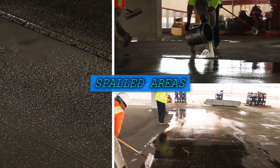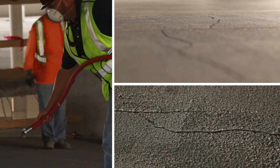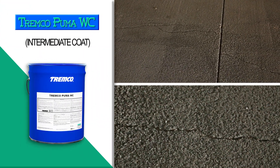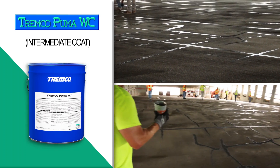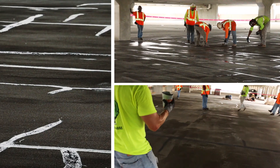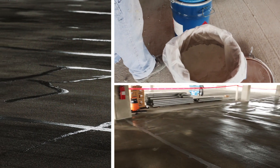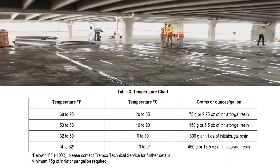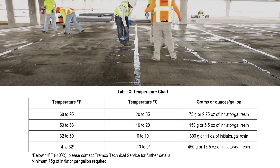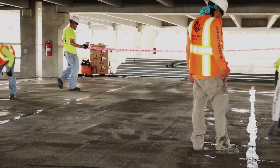Spalled areas should be cleaned and free of loose contaminants prior to repair. Due to the fact that job site conditions vary, it's recommended that you contact Tremco's technical service or your local Tremco sales representative for the best method of repair. Mix Tremco Puma WC for 2 to 3 minutes prior to the addition of the silica sand. Begin with 10 pounds of sand for every gallon of Tremco Puma WC. Additional sand can be added if a thicker consistency is desired. Once Tremco Puma WC and the sand are blended together, combine this mixture with the Tremco Puma initiator. Please refer to Table 3 of the application instructions for addition amounts. The Puma initiator addition is based on the ratio of initiator to Puma WC amount. Pour Puma WC with sand mixture into cracks and strike flush with a roller.